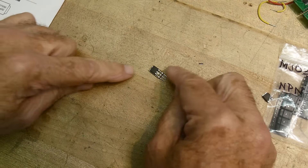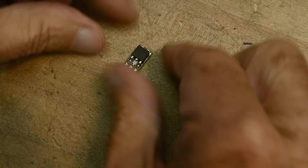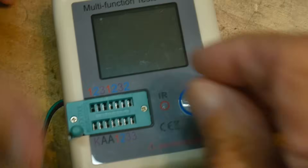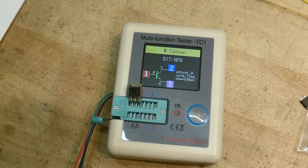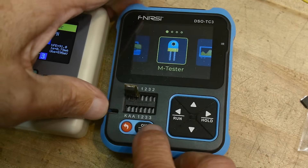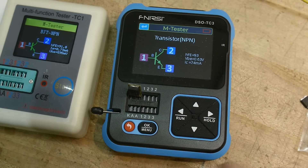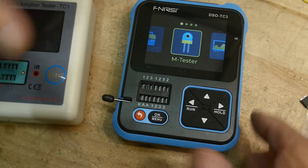What I'm going to do is I already have a little 3-pin adapter board here. I was able to solder it down, and I have the big tab coming out to the center pin here, so we can put it on a tester. This one says it's HFE 091. Let's try a different tester and see if they can agree with one another. HFE 93 — very good. So these things agree with one another. I do like this tester; I think I just like the graphics. This one works fine.